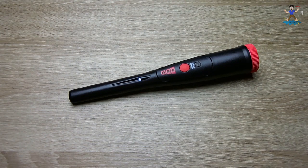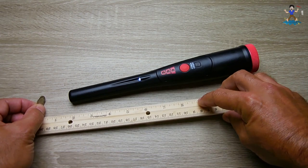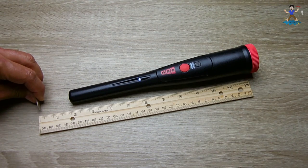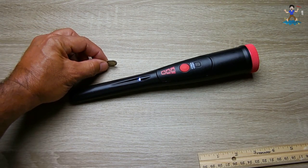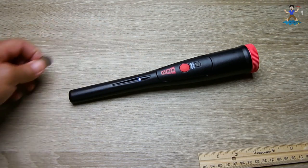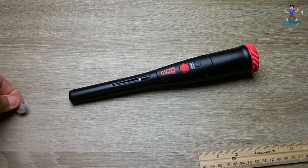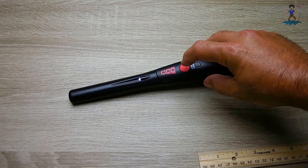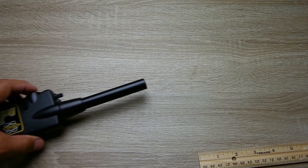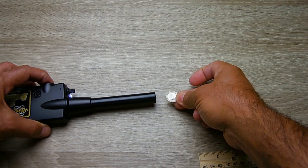Now trying a silver dime — about 1 and 3 quarters inches both face-on and at the sides. On side detection the silver coin goes further away compared to the base metal coins. Comparing to the White's on the silver dime — only about an inch and a quarter, very similar detection on edge. So if you're looking for silver coins, you should do just fine with this unit.